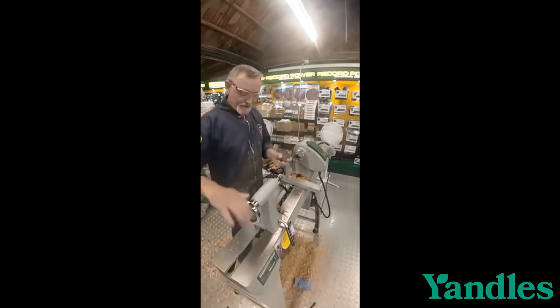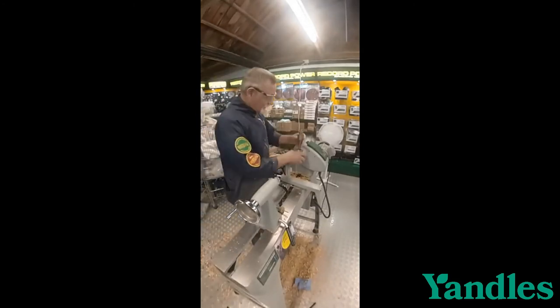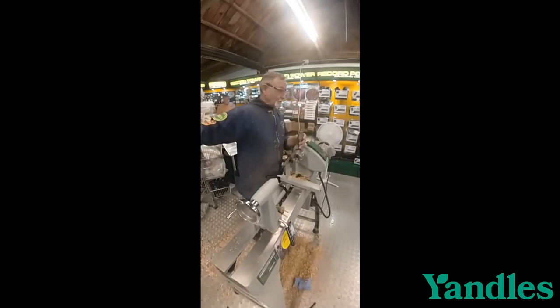Right, this is my live centre, threaded live centre. Again, this is from an engineering company. It's a 3/4-16 live thread. The most useful thing you can ever have. You can do it with the Axminster one, just as easy as what I'm going to show you now, but this is the one I'll be using, so I'm going to demonstrate on this one.